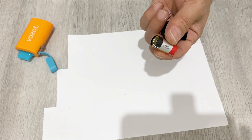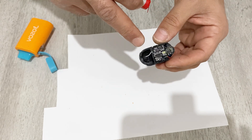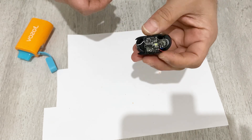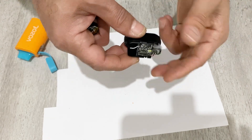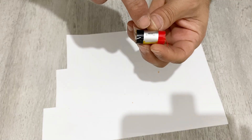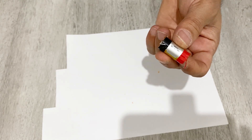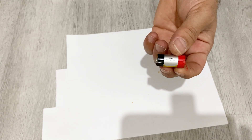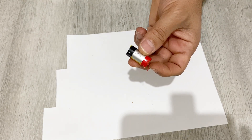As you see, it's very easy to get a lithium polymer battery from electronic cigarettes. This part is the charging module for lithium ion and lithium polymer batteries — I'm not going to throw it away, I'll use it for other projects. When you read the values of the battery, each battery is about 1,500 milliamp hours, so when we combine six of them it will be approximately 10,000 milliamp hours for our power bank.